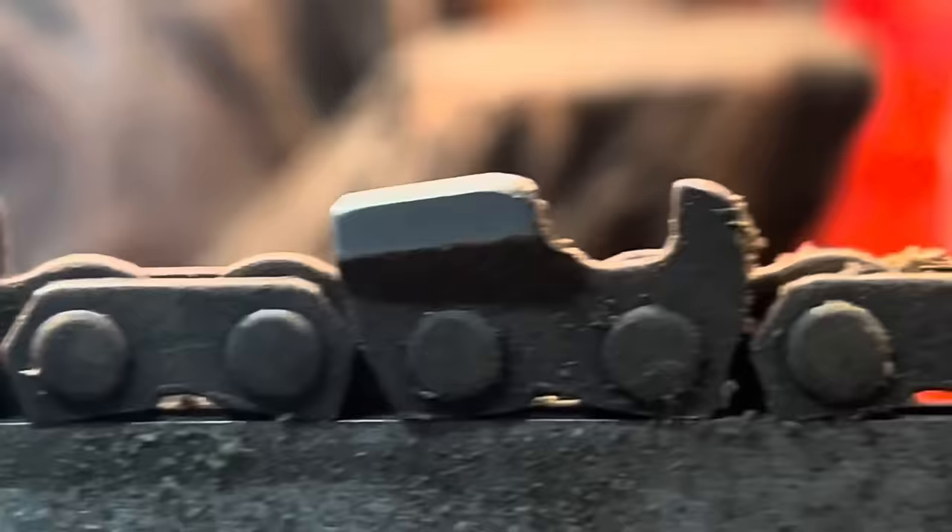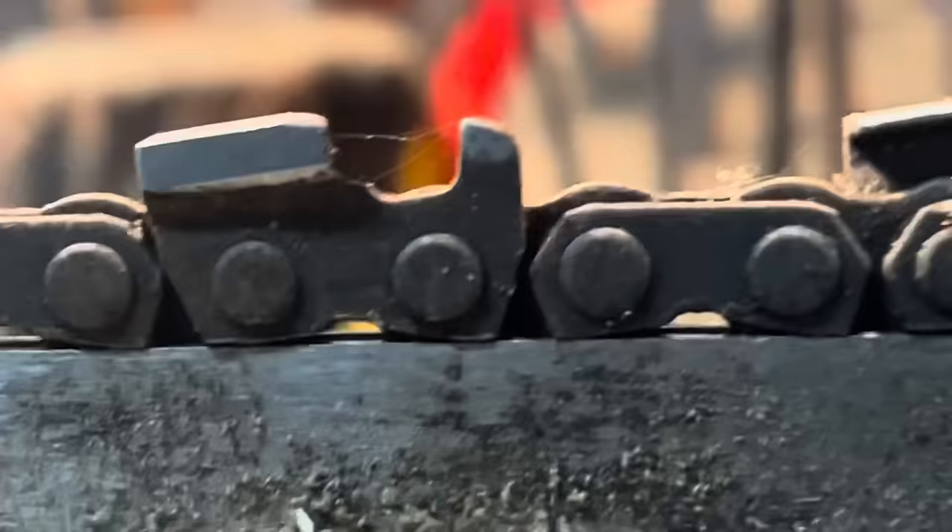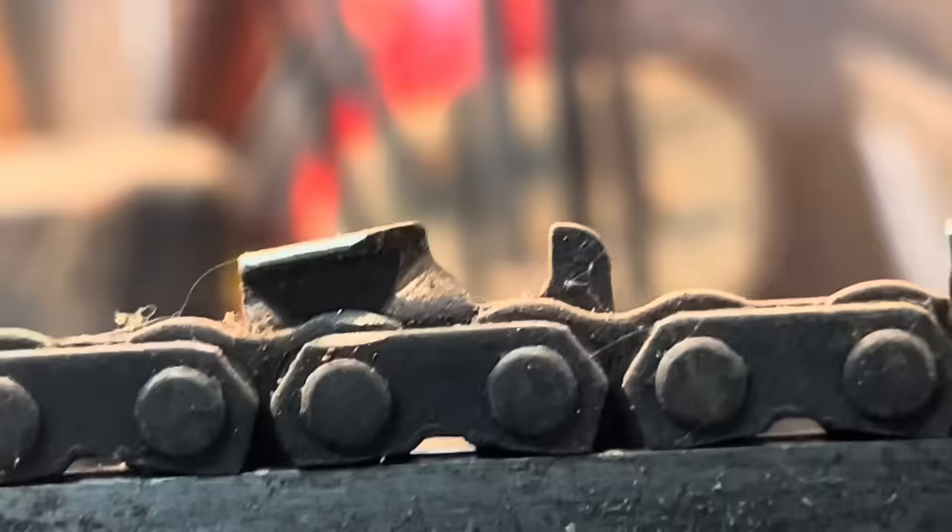This gentleman unfortunately didn't know what was happening. He smashed the tooth - smashed the corner right off it. See it? It's gone, it's dull, it won't cut a thing. It's horrible. The rakers are high. Look at that beautiful locust I had there with some raker gauges on there. See this one? The cobwebs on it? There's another - that is a ski jump. It will cut nothing.